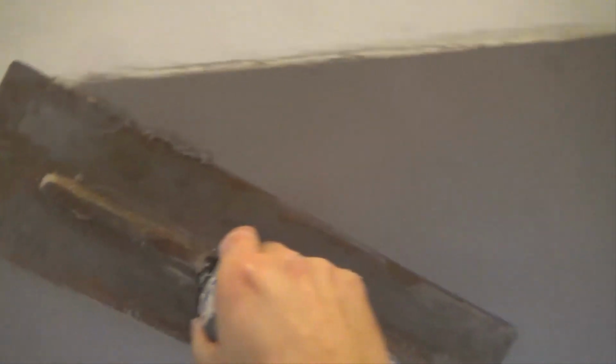So just really scissoring it off, sawing it off, flush both sides. You can use the top of the trowel as well, guys, just like so. It's not that difficult when you know what you're trying to achieve. And then later on, I'll do this with a wet trowel, but I'll trowel that all up again and wet this edge up, and it'll tidy it all away. A bit difficult to do it with one hand here, but I'll try and get the tripod up after I trowel up the bottom ceiling here shortly.